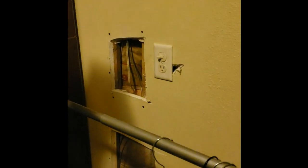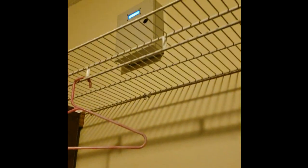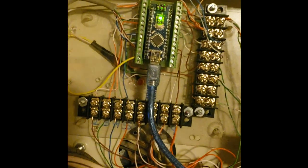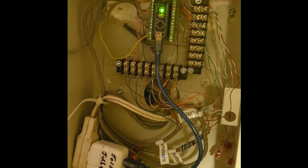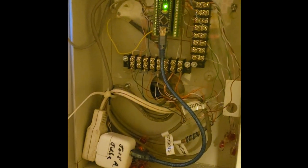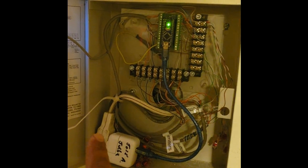We still have a little bit of work to patch back up, but we wanted all the wires to be run through the walls. I installed a switch with an outlet so that the switch can manually shut off the elevator system. This was my first prototype — it has a status indicator that tells you what floor it's on, and it's all controlled by an Arduino Nano. I installed some relays in the actual hoist system that are 5-volt input and will operate the 110 volts that the hoist runs on. The entire elevator system's brain works on this little Nano, powered by a USB plug.